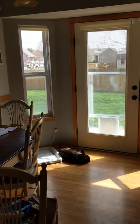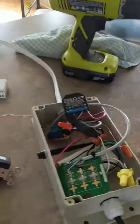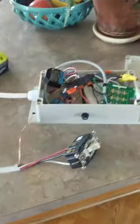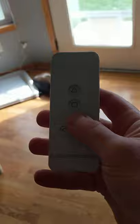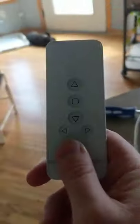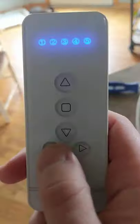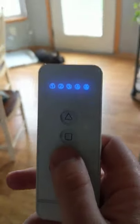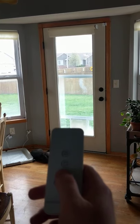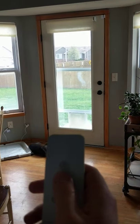I'm gonna go ahead and run wires on them so you don't have these wires hanging out. All RF controlled. I did give an option — the problem with this is that you can't control position, like if you want one to be at a certain position. So that's where you'll need to use the remote. I've paired two remotes with this. First I set the limits with this remote — it's a five channel, so you can see the different channels here. You can do individual channels or all of them. I'll go down — hit the down button, it goes down. Hit up, and it goes up.